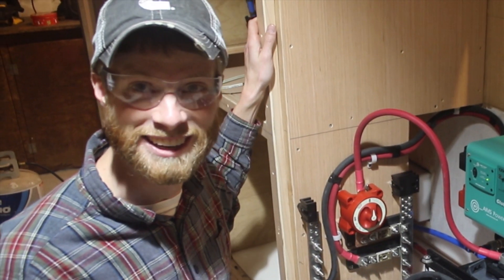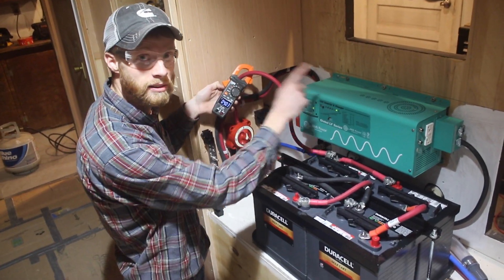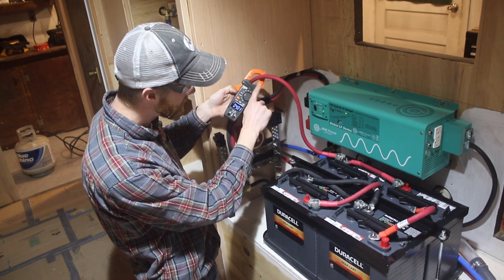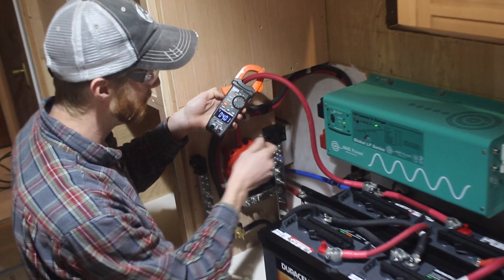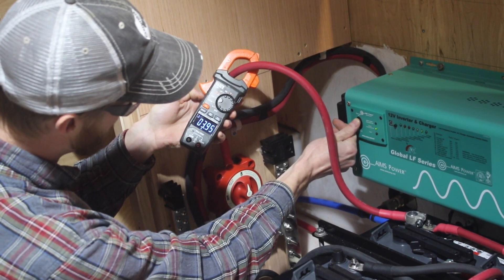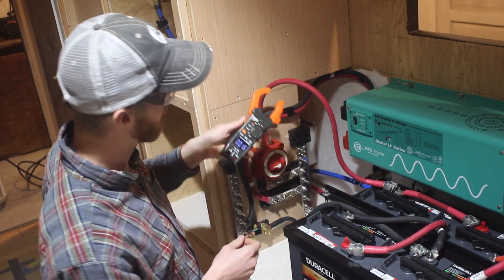Very exciting - that's what you want though, you don't want problems. The inverter is on and it's just idle right now. Here's an ammeter around the positive side off the main battery connection, and we've got four amps being pulled. If we turn it off it should read nothing - point two. The wire itself produces that much.